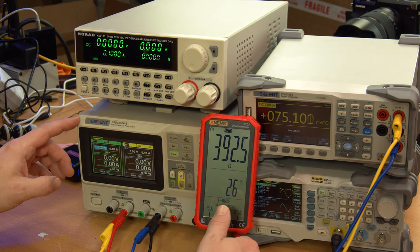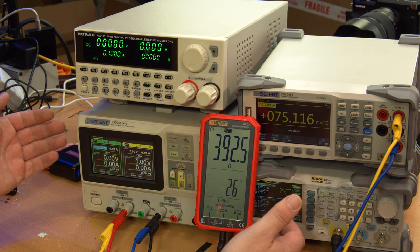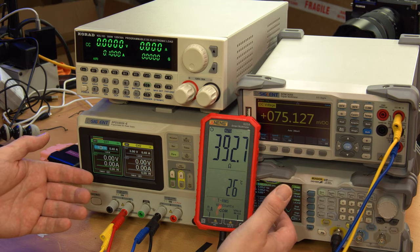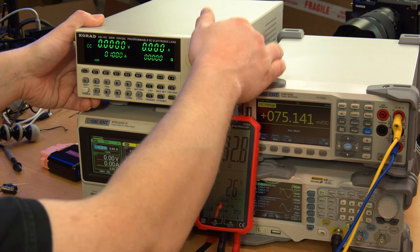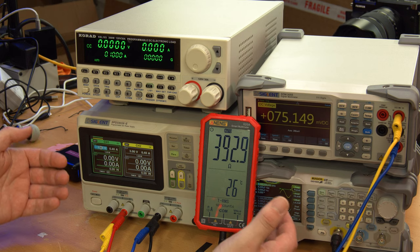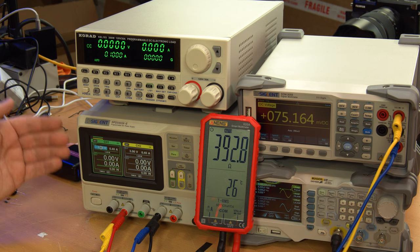Okay, so this is a bit awkward. Apparently that Rigol power supply is not capable of series or parallel operation. I'd never tried to use it for that because I just got it recently, and it's kind of a surprise. I checked the manual even, and the word parallel didn't even appear in the manual. And the only time the word series or serial appeared was as far as a serial data connection or the series of the unit, like in the model number. So weird. At least I know this Siglent power supply is capable of going into series mode, and I can go to higher voltages now, although not terribly high.